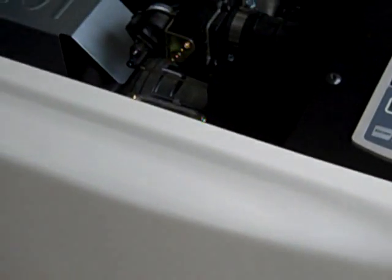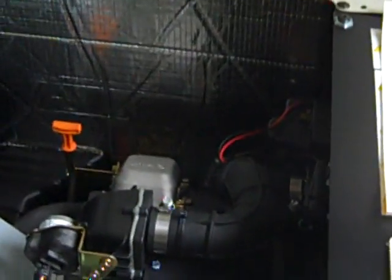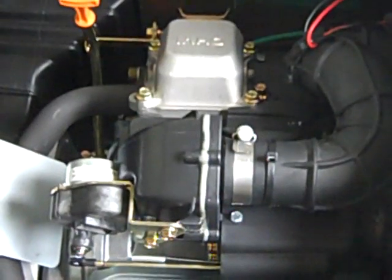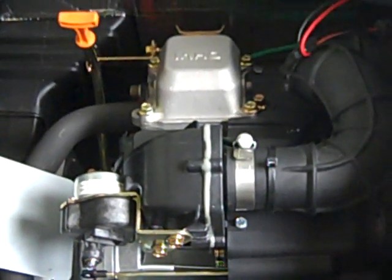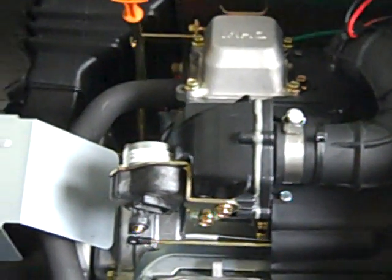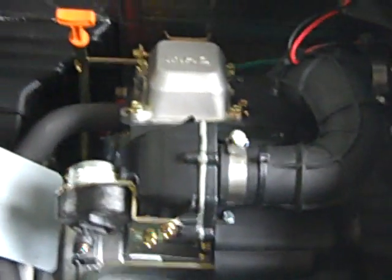The way we typically do this is set it up to run the whole house, and we've done a lot in this home to lower the electrical load. We know this baby is going to burn some propane — this little V-twin runs at 3,600 RPMs and it's going to burn at least a gallon an hour, probably more depending on the load. You can go from three-quarters to a gallon and a half an hour, so your propane won't last long when you're running one of these.